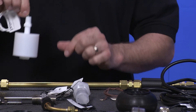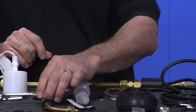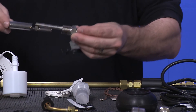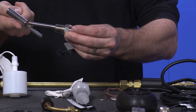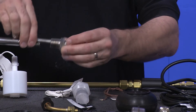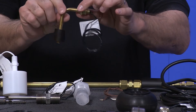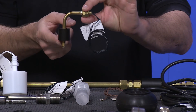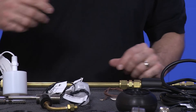The vertical mount is typically the most popular. They have a normally closed configuration and are typically mounted in the top of a tank. The horizontal style is mounted in the side of a tank. The bent stem style also mounts in the side of a tank like the horizontal switch — three of these operate the same as a vertical switch and one operates as a horizontal switch.